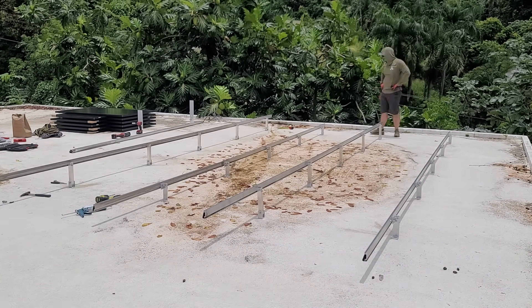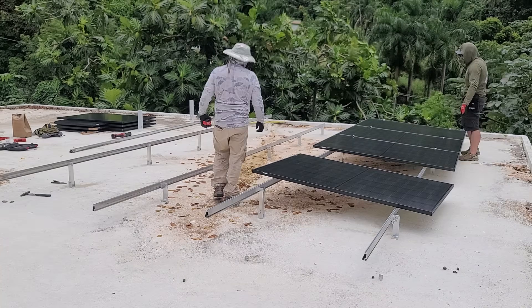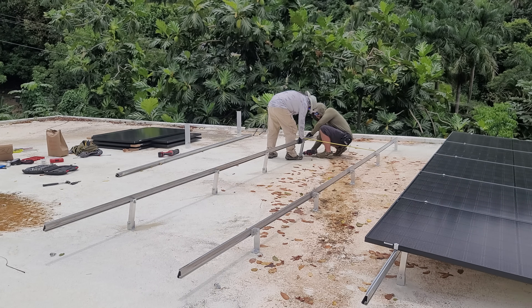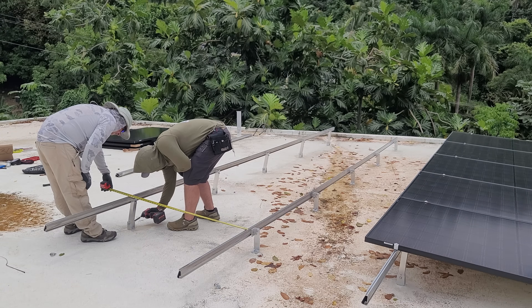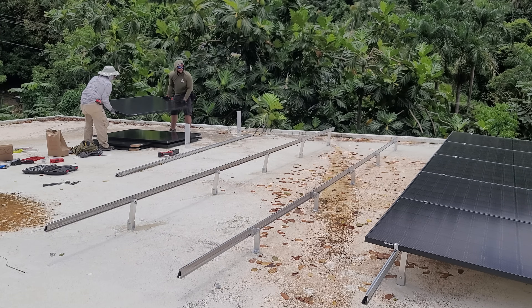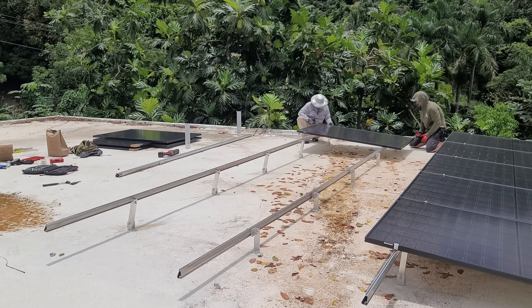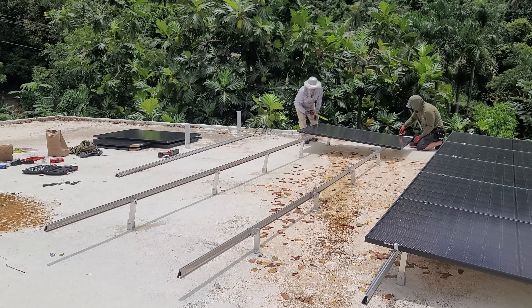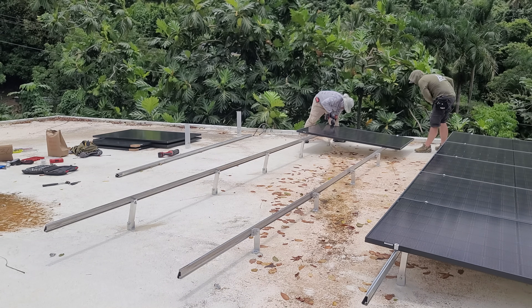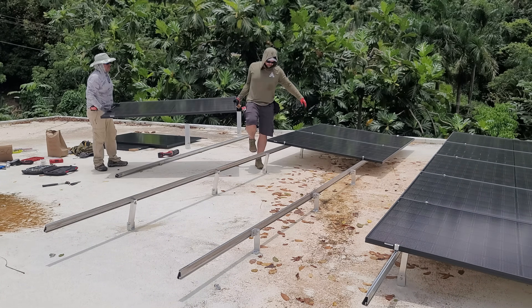We're making sure each solar panel is lined up properly along the rail so everything is square. For this configuration, all 10 panels are wired in series but split between two rails since 10 panels won't fit across the roof in one single group. With how much sun Puerto Rico gets, there's a really good chance the system can produce upwards of 30 kilowatt-hours a day fairly reliably. The customer can also add an automatic backup generator that kicks on if the batteries run out, recharges in two to three hours, and restores about two days of stored power. With a white roof like this, bifacial solar panels are beneficial because reflected light hits the back of the panels and produces additional power.